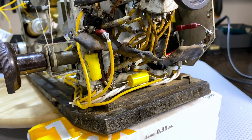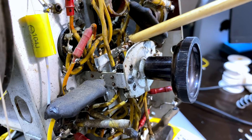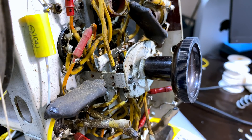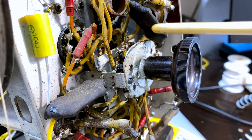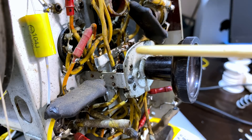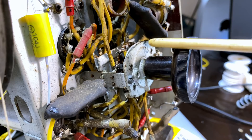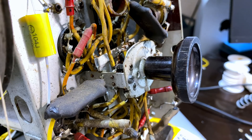Then I faced a bit of a challenge, and that was the switch because I believed that something was broken there. I found a very similar video by Don's Old Radio Shed - Don had done one very similar to this one and he had the same problem. The difference was he got shortwave but didn't get medium wave and long wave. He ended up dismantling the switch but found he didn't have to - he just had to replace the capacitor. But I wanted to check because he did say he found some dry solder joints that just broke off when he touched them.